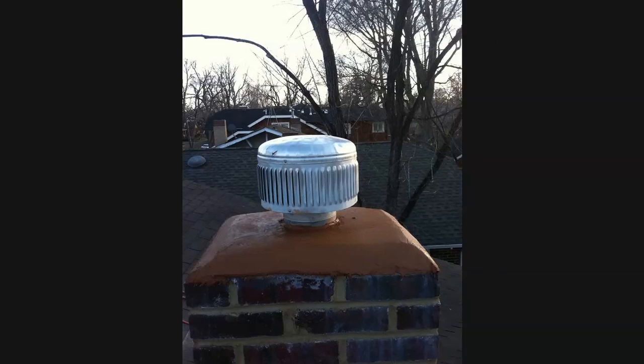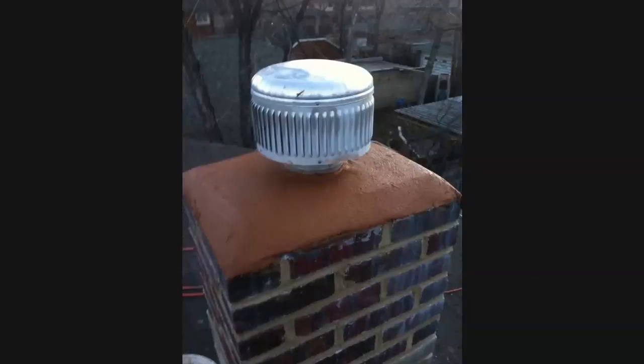Here's a close-up image of that. We really built this up pretty thick — probably about 2¼ to 2½ inch thick mud, and I just slope it straight down to the edges so water's not going to sit here and it's going to drain off. There's another image where you can see the sponge marks where I've put a little bit of water on a damp sponge and just sponged it.